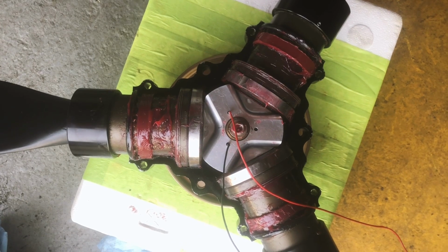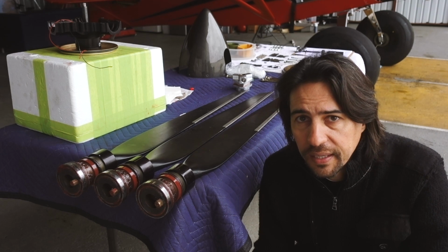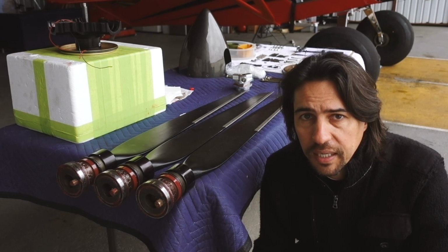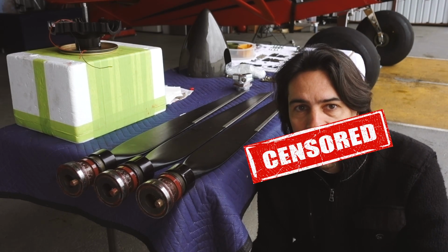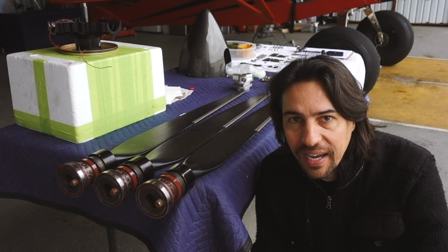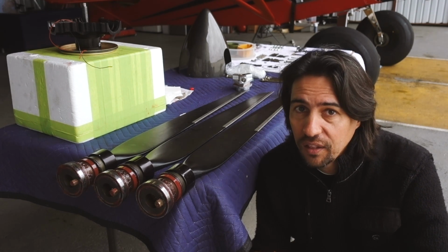It's an in-flight adjustable, and the manufacturer went out of business 10 years ago. So I inspect and lubricate the hubs every year. However, in order to lubricate the hubs, I need to take everything apart, which is a pain in my... this engineer that designed this without thinking of the guys servicing it. But I love the in-flight adjustable prop.